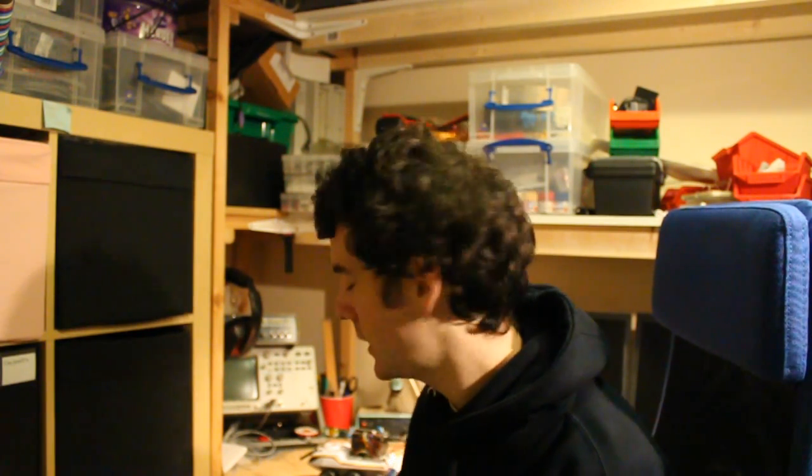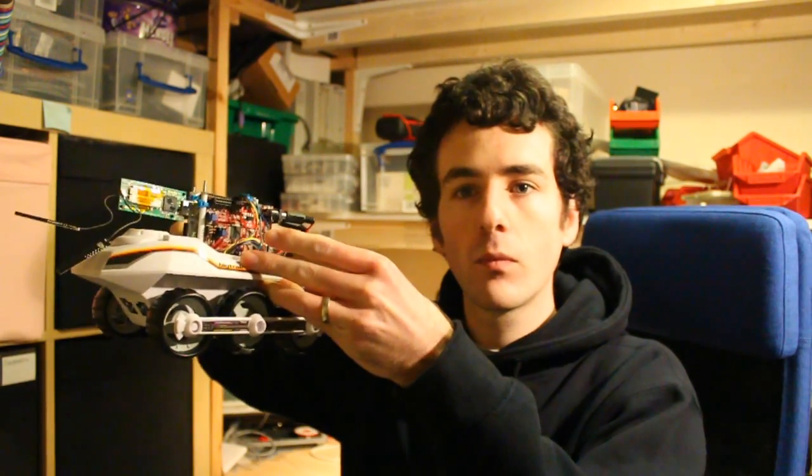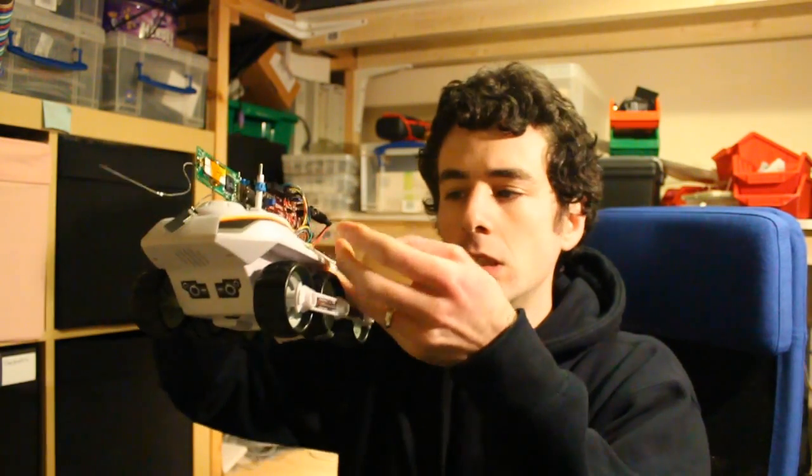Right, it's been quite a while since that first bit of video that I did with the BigTrak. Lots of things have changed and it should be working now. So here it is. Lots of boards on top of it. So first thing to say is the plan about emulating the keypad didn't work out at all. I scoped it out for a while and it turns out it's really complicated, the key scan. And actually emulating it would have been a pain, really difficult job to do.